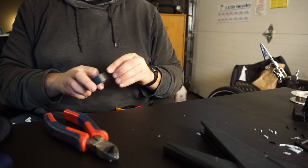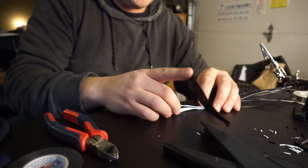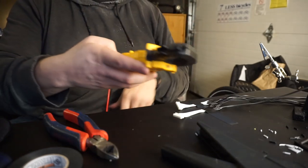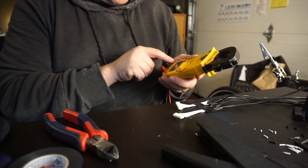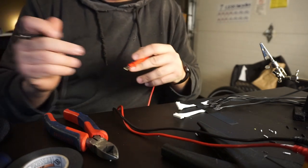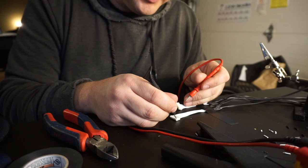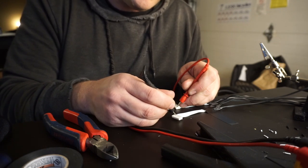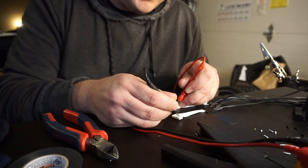We've got our voltmeter here. I'm just going to electrical tape these cables down to the table because there isn't really a good way to hold any of this while we're doing the probing. We're going to be using the diode check mode on this thing - got our beeper activated. So anytime these two probes are connected together, the meter will beep. That makes this testing pretty easy - just put one probe on one pin and the other probe on the other, and we get a beep. For each one, I'm going to check all the other wires to make sure we don't have cross connection.